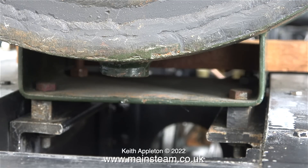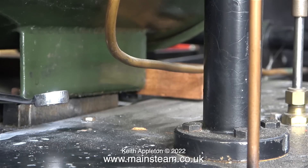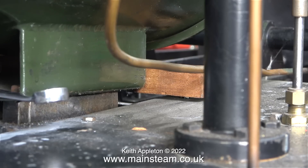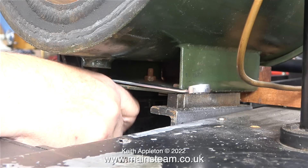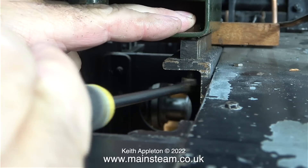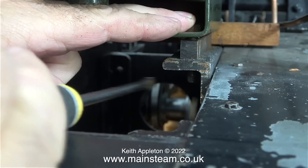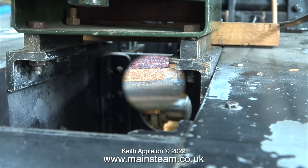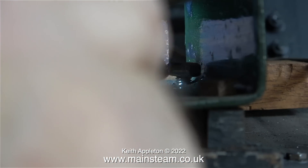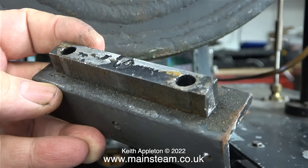Now it's fun time — I have to release the boiler from the chassis at the back. This fitting is entirely wrong in just about every way possible. I'm lifting the boiler a bit higher and inserting another piece of mahogany because I need to work on this and it's difficult enough without it being too low. Health and safety warning: if you're doing a job like this, make sure any weight is securely held and cannot possibly fall onto your hands. Well, I couldn't believe my luck — these bolts that I thought were going to be a major problem were finger tight. This does add some weight to my theory that the man who built this engine by this stage was getting really fed up of it and didn't even bother tightening these bolts. Which is not good, and worse than that, there is not an expansion joint.